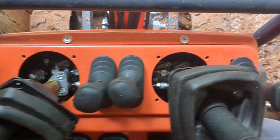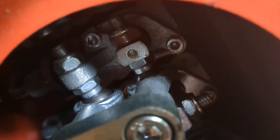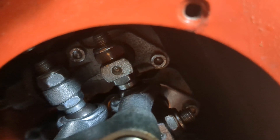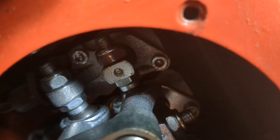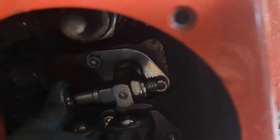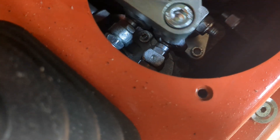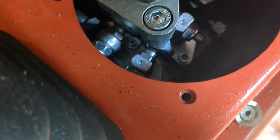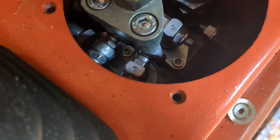We're going to have to look into this further. We pulled up the boot on the other side, and when I try to move the stick over here, that front plunger has a very definite centering on it — that is not what's happening on this side. This side, that front plunger has quite a bit of travel in and out, and no good centering.